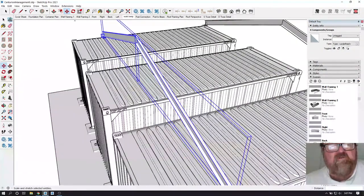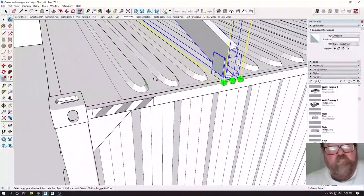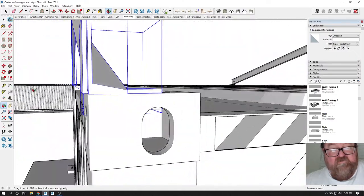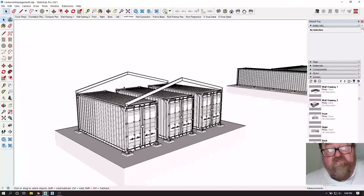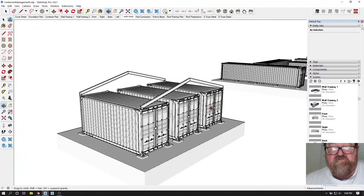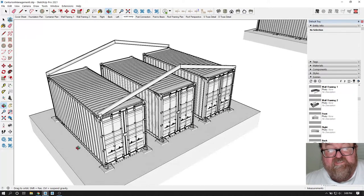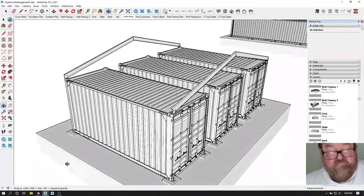And see, once I got my one rafter done, now we're cooking with gas. But yeah, if you're talking about feasibility type stuff, David's a pretty sharp guy, and he went through all that sort of feasibility stuff and determined. One simple point he made was that his site has a slope on it that typically wouldn't be conducive to a storage complex. But what he can do on these is step these footings down a little at a time. There's going to be a bunch of these modules. He can step them down the hill, and he doesn't have to worry about doing all that site work. And he can just have a gravel drive, and this is one of those kind of deals.